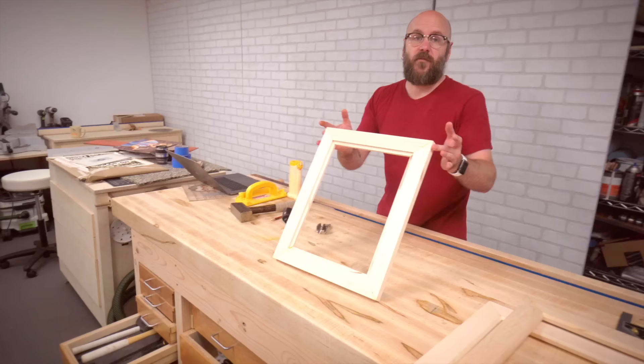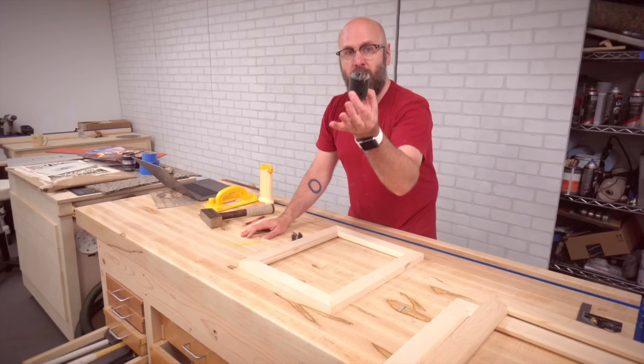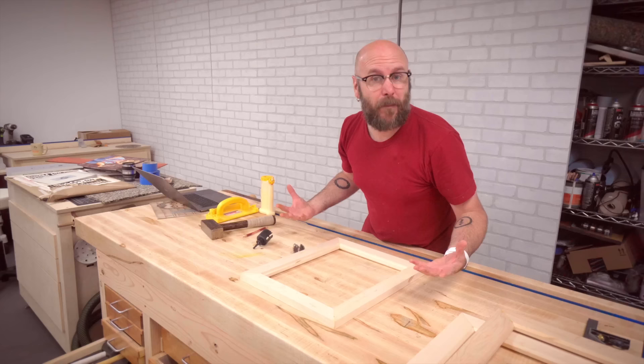For this one we're not going to do splines — we're going to hack it. We're going to take a Forstner bit and drill down about one eighth of an inch, then take a hole saw bit and cut out of one eighth inch plywood a little circular disc that will fit in there. This is the back of the picture frame so it's not going to be pretty, but you're not going to see it — plus we're going to put a dust cover on here. Let me show you how that's done over at the drill press.